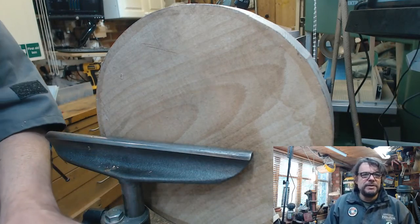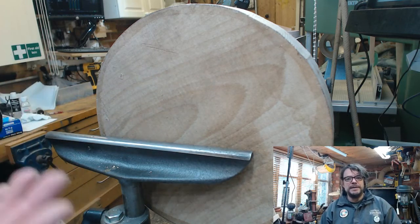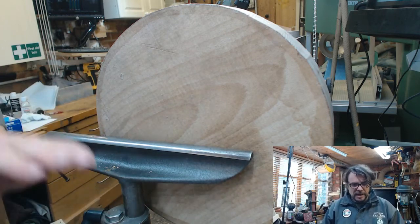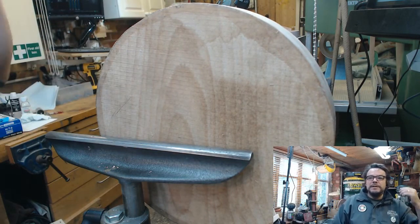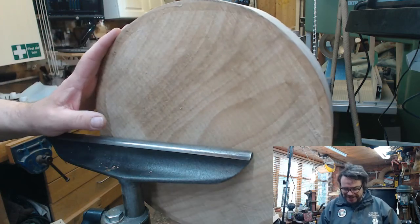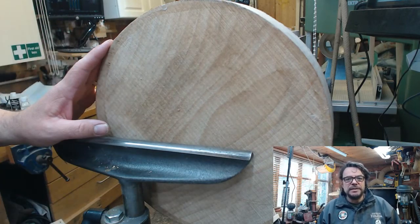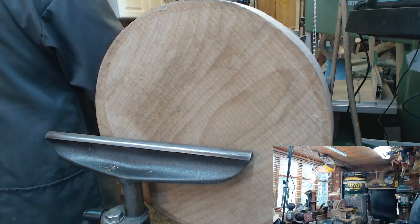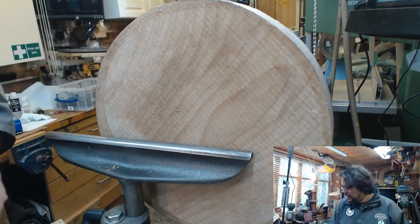But the reason I use the spirit stains, or stains, is, one, they're thin already, so I don't have to thin them down. They work absolutely fine straight in the airbrush to begin with. Dust is a wonderful companion in the woodturning world. Dust and paint, well, texture, sludge, can go with that from time to time. But stains don't mind the dust. So that's another reason for using stains. The stain will soak into the wood and the dust will just dry on the top and then disappear.